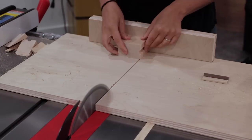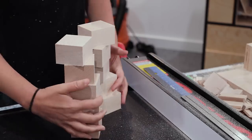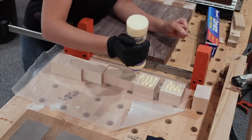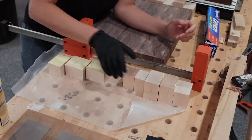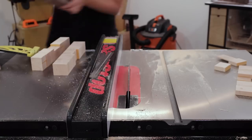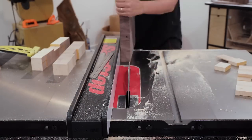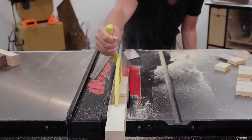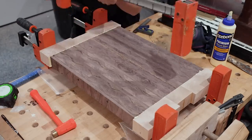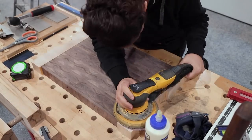I tried every which way to incorporate those dowels and rounded grooves into the board but it all seemed too busy, so I cut them off and glued them into a stack. Once dry I trimmed them up at the table saw, using the actual thickness of the main board to trim them to final width — actually a hair thicker than the main board in case anything was misaligned during the glue-up. I lost count of what number glue-up this was, but it was pretty straightforward and uneventful. Still dreaming of that drum sander.